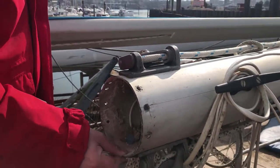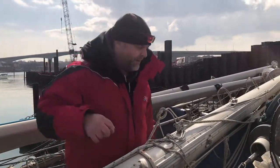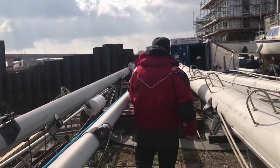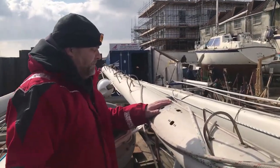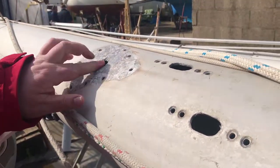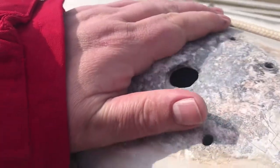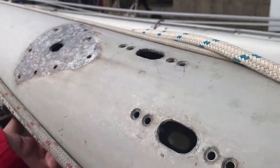By the time you get it back to decent metal, there wouldn't be a lot left. If you come around here, I'll show you the rest of it. So that's completely worn away as well. If you feel underneath, between here and here, you can see how thin it is — that's how thick it is there, and even that's worn a little bit. That's a millimetre. So by the time you ground that back to decent metal, there's not going to be enough left. And it's worse on the underside as well.